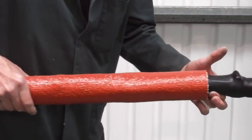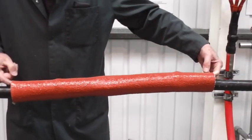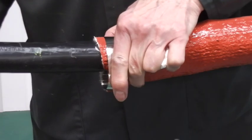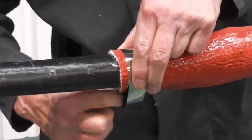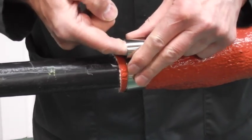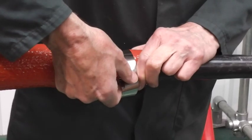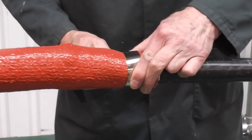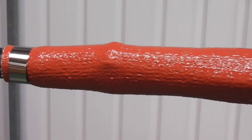Now position the outer fire barrier tube so that it overlaps past the zero halogen tube beneath, and utilising the constant force stainless steel springs, secure into position. We also have fire resistant joints which are very similar but incorporate mica tape.